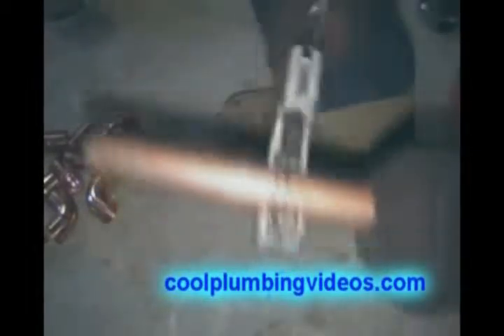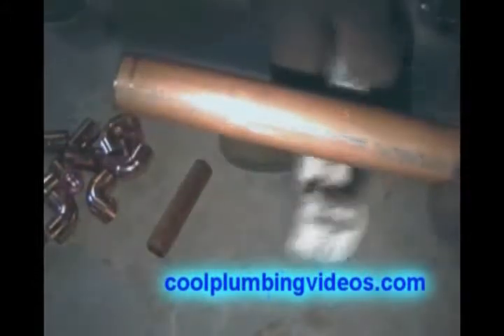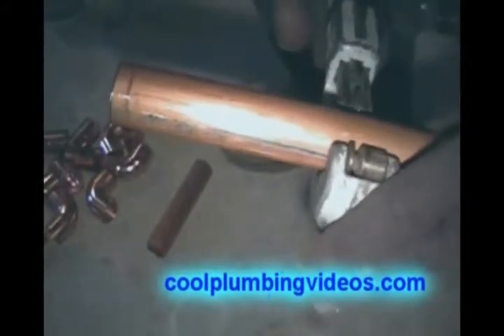You see here we're cutting the pipe — 3/4 inch pipe with pipe cutters. Every time I make a turn or two, I just make a little twist to tighten it down a little more. Twist it a little more, and eventually it pops loose. We'll do this again — just cut a couple turns, turn the handle, tighten down on it a couple more turns.